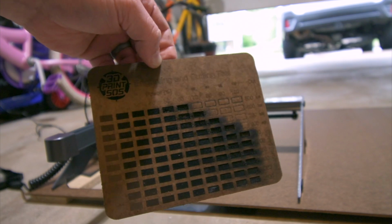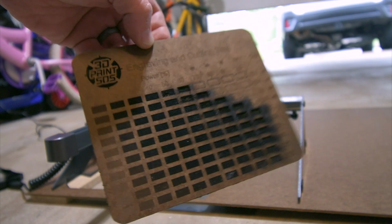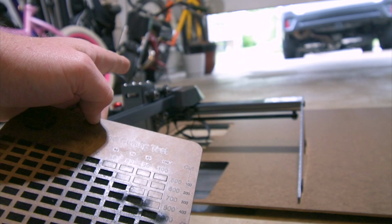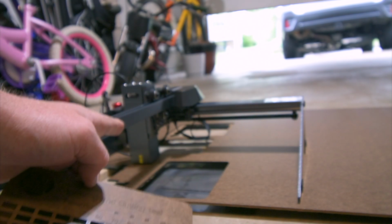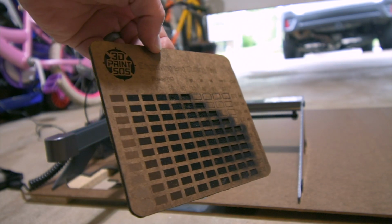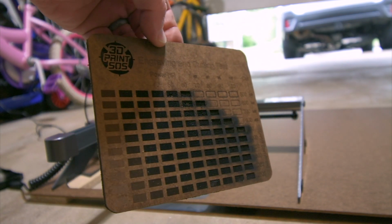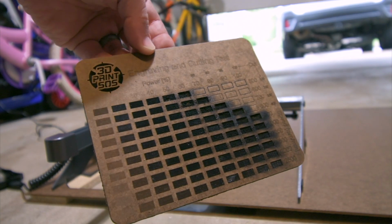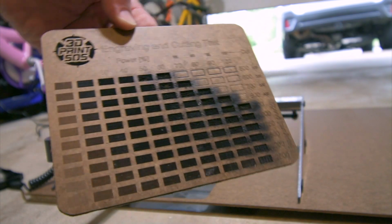So definitely useful. I'll have the file down in the description below, so you guys can just put this on your SD card with this machine or anything that uses that laser module, and you should be able to just use this on whatever material you're trying to test on, and get a better understanding of what settings to cut and engrave with.